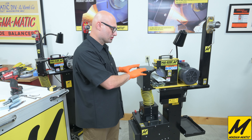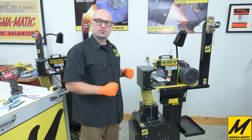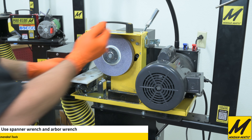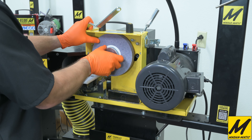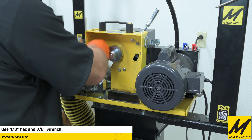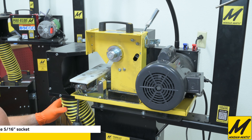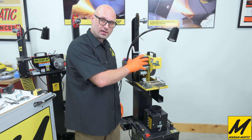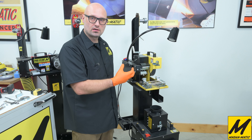In this process I'm going to remove the grit guard. Now this normally wouldn't be necessary, but for the video I'm going to remove the grit guard so that you have a better view of how we're getting the bearing spindle out. We'll begin by taking off the front cover and removing the grinding wheel. Remember the grinding wheel arbor nut is a left-handed thread. Now that we have the grinding wheel off, the grit guard off, and the modular work table insert removed, you have a lot more vision to see where we're going in this bearing replacement video.